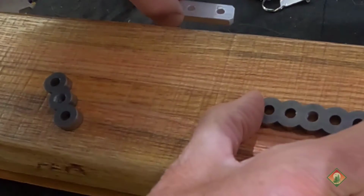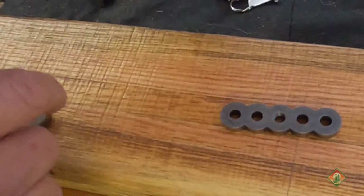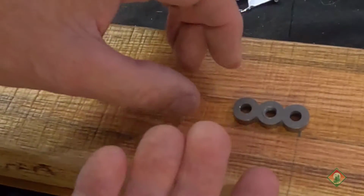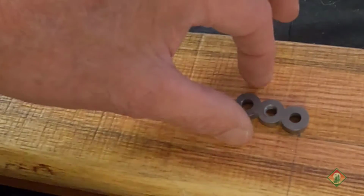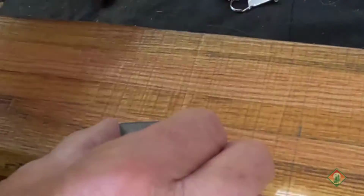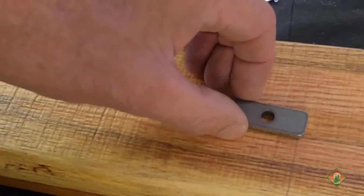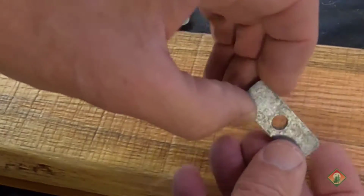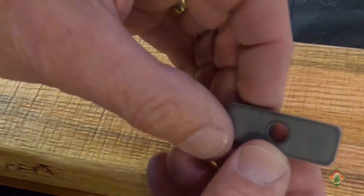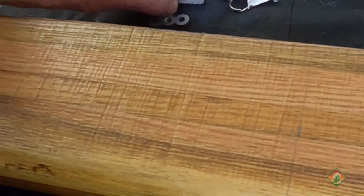Or it's going to get what I call a 5-hole, which is similar in size. It uses the same mortise, right? But on the other side, I'm going to set it up for this. And again, I don't do DIYs on those. They're just too small, and it's 5/8 wide, and it's too hard to get the 5/8 inch flat bar. But it also is going to work with these washers that I get made up, or a person could quite easily make those. Again, if you can get 5/8 inch flat bar, it's just a little harder to find. And then it's cutting it and then drilling a hole and it becomes a washer.